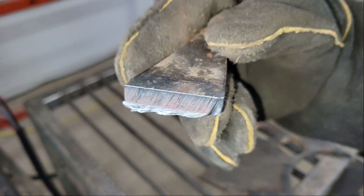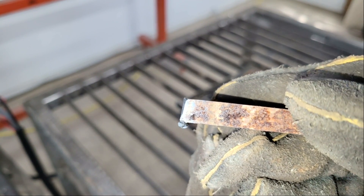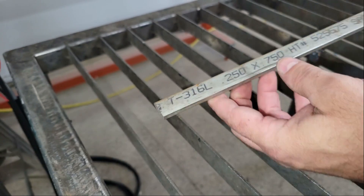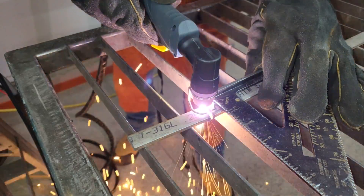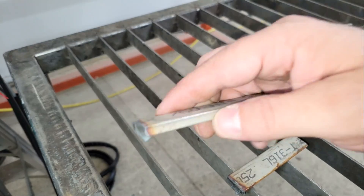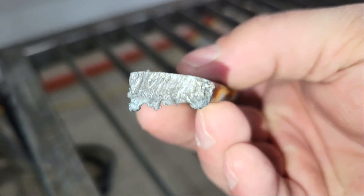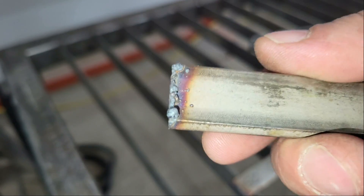I think I should have increased the air pressure to around 50 psi, but it still worked great regardless. I'm pretty impressed with this little machine. Next I wanted to try something a bit different, so I set the machine back to the settings I used for the 6mm plate to cut a piece of stainless steel flat bar. I've never cut stainless steel with a plasma cutter before, so I'm sure I need to play around with the settings a bit more for a cleaner cut, but it can cut it nonetheless.